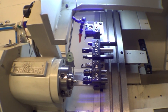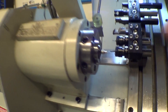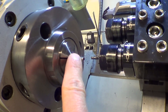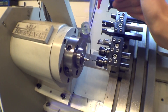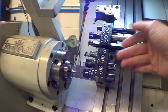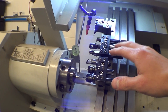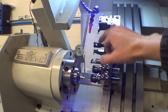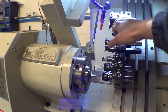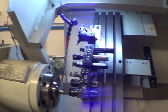I'll show you. I'm making a pivot here in 17-4 PH stainless steel. All I'm going to do is take a known tool — any fixed diameter cutting tool that I know has been zeroed yesterday or the day before. You can't do this with a tool you just put in today. I'm going to choose tool 15 because it holds good tolerance and has a sharp insert.